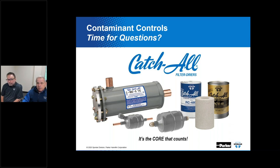I'd say the filter dryer that's there is, within its limits, going to do what it can with its affinity for moisture to collect moisture. But to do the job right, I'd say you're going to have to do more than just rely on that filter dryer. The system's been exposed. It's been opened. It needs to be serviced and a new filter dryer installed. I don't care if it's ours or somebody else's. Yeah, right. Because there are limits of how much moisture it can sequester, right? At some point, it's going to be saturated, right? Exactly. And again, if there's any length of time involved at all, just like we've said in that earlier slide.